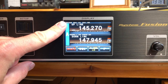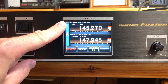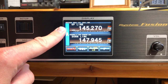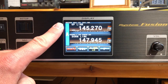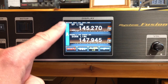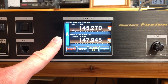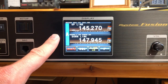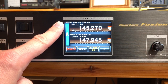The top one, 145.270 — the Painesville repeater here for example. That is the output frequency of the repeater. So when you're in your mobile driving around, you tune in your VFO to 145.270. In the A section, it's taking the output of the repeater — what everybody would hear on 145.270 — and actually feeding it into the input of the repeater that we would try to link it to. The very interesting part, which you might assume to be problematic, is that this repeater transmits a DCS code.